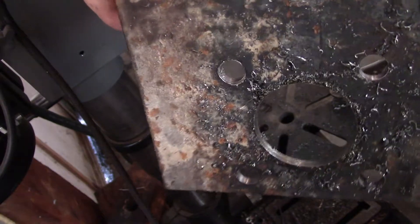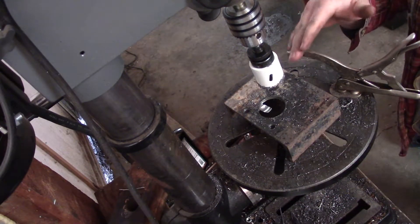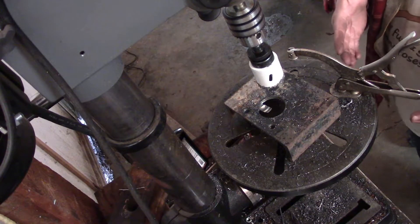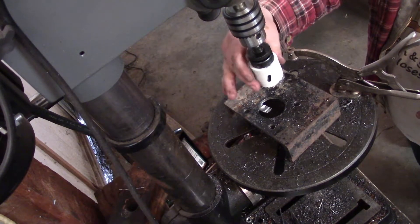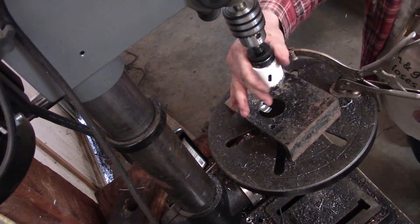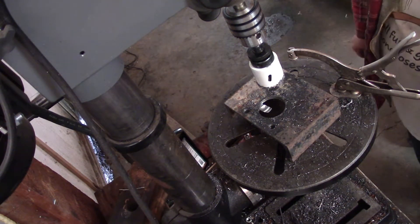You can see all the little teeth marks and everything — it's not oval shaped. You'll get a lot longer life out of the bit that way too because it's not vibrating so bad. The chatter I was getting toward the end was because I was almost through, and no matter how accurate you think your drill press or hole saw is, they all got a little wobble in them. When you go through, it always seems like one or two teeth will go through sooner and then it'll start chattering as it goes around.